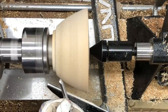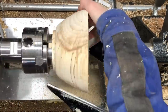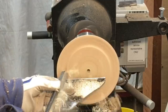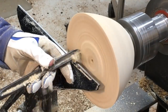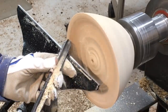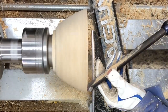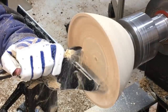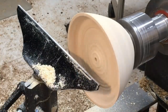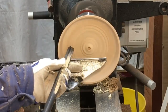I'm just doing a little shear scraping getting the surface cleaned up. I always check my tenon and make sure it's still secure before I pull the tail stock off. I still have some issues getting some ridges or grooves — or maybe it's more of a burnishing — way out here on the edge. What I'm trying to do is get just the very edge as thin as I want it and then not go back to it, basically leaving as much meat in the bowl as I can to help dampen the vibration and keep it from flexing too much, and then just go a little bit and not go back after it. I'm not really always very good at that, but that was my plan.